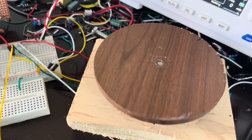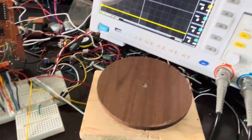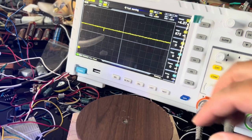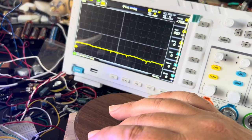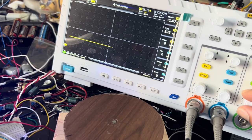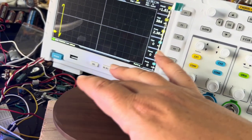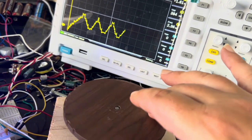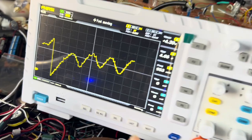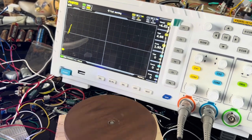Since I have this on 5 volts, it should give me a reading between 0 and 5 volts. Let's test it out. We have 4.37 volts. Now let's go to 0. And that's the voltage cycling as I turn this. If I spin it, it does the trick.